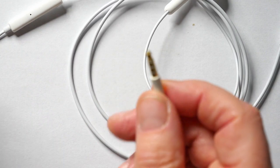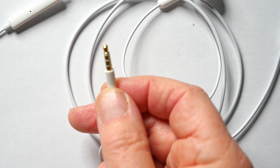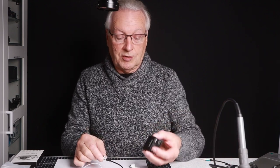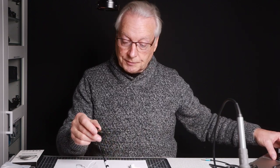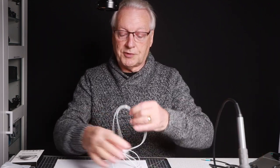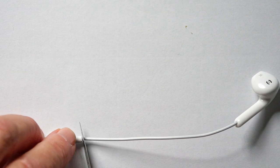If you have a USB-C Android device you'd use the appropriate adapter. If you want to use this with your camera you'd need a TRRS to TRS adapter like the one I've got here. That would plug into your phone, or as I'd be doing, using the Rode Wireless GO or the Sennheiser wireless lavalier system — just plug into the microphone socket on your transmitter worn on your belt. Now let's start the project. I'll show you how to do it without disassembling the microphone — just take a scalpel and cut the wire off at the end of the rubber bush.